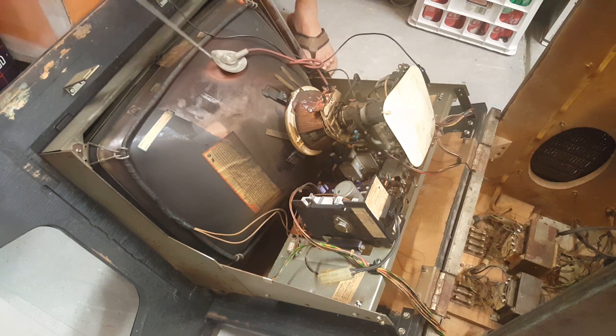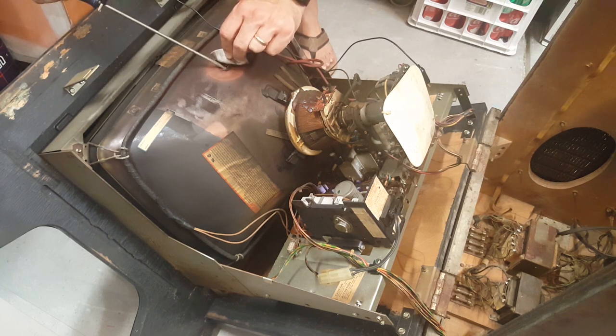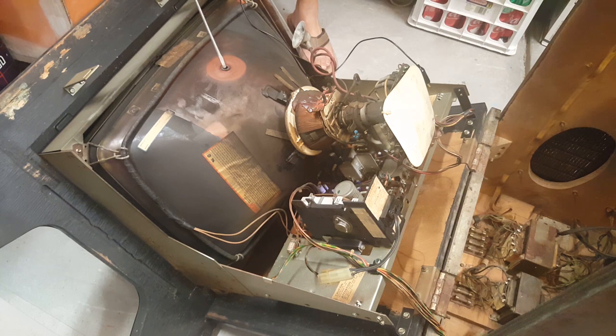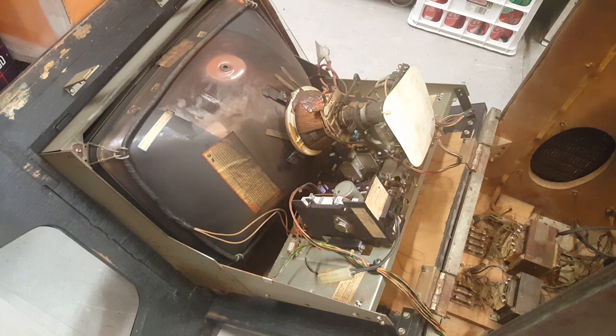No pop. Yeah, that means this monitor never charged up. So because of that, we can just pop this thing off here. See, there's no spark or anything. If this was holding a charge, you'd see a little spark and hear a little snap when you do that. So that's good to go. Now all we need to do is make a few disconnections and then reconnect the new one in. For this side, I'm going to move the camera to the other side here.